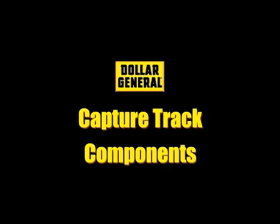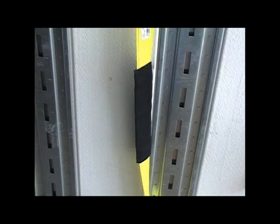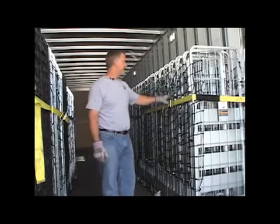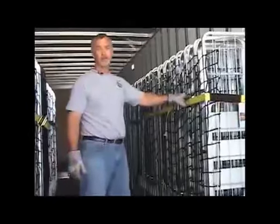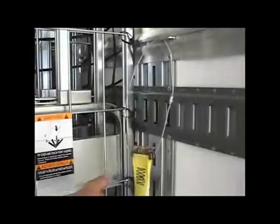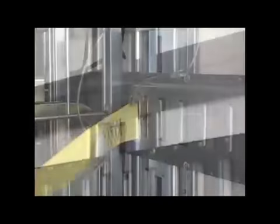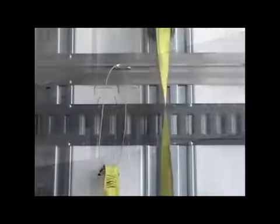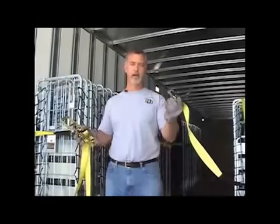The Captured Track system is comprised of five components. First, do not attempt to nest more than 10 empty roll tainers when you utilize the Captured Track securement system. Remember that the narrow end of these roll tainers needs to be facing towards the front of the trailer. The E-Clip Securement Strap is attached at the wall by a 12-inch cable connected to a sliding T-bar that can run the entire length of the trailer. This system was engineered to ensure that the securement devices would always be available and in your trailer at all times. Each strap is divided into two sections, connecting at the Torque Limited Breakaway Ratchet and the Ratchet Connection Hook.